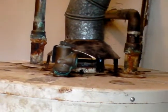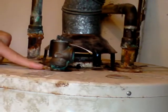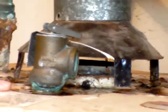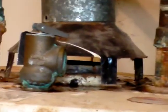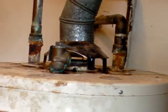Okay, one, yeah, there's water in here. Is it leaking? If it's leaking, like what you see right around that, what is this thing called? Pressure pop-off valve, whatever, but yeah, pressure release valve. There's water around that, okay? But that's certainly an issue. What's the other source of water? Condensation. Condensation that results from combustion, exactly.